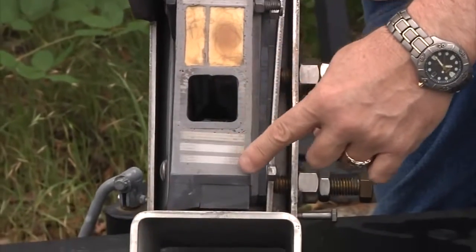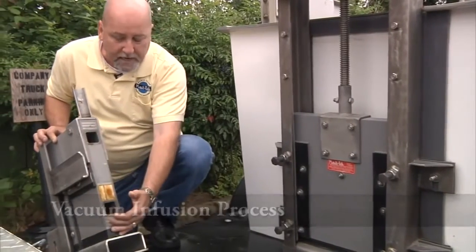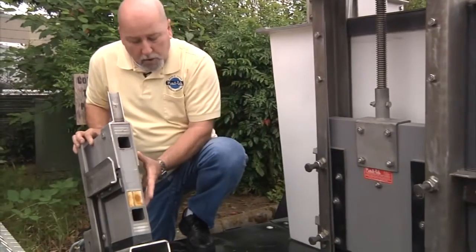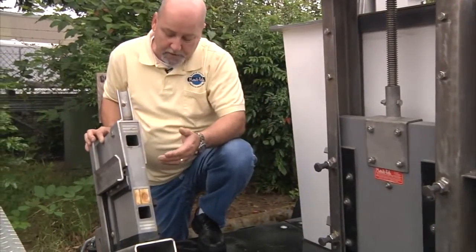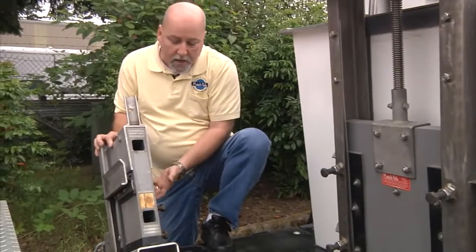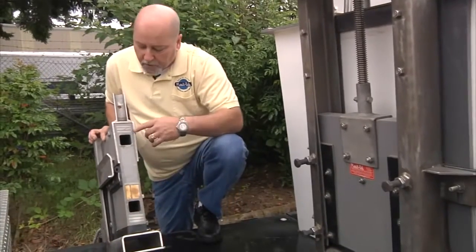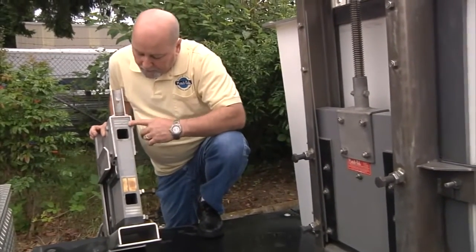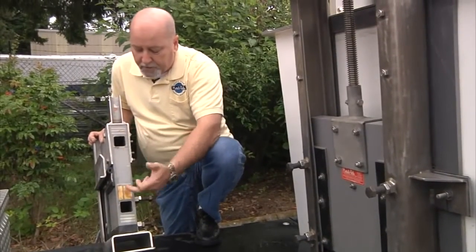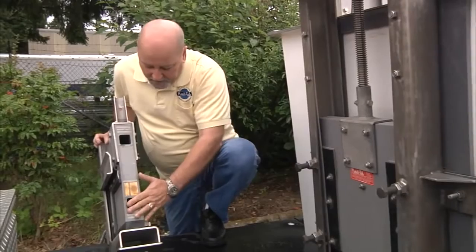The gate itself is a vacuum infusion product. What we do is it's actually made inside of a mold where we layer the fabrics down in the mold. We'll actually put a steel tubing inside of it, and we use a foam to help keep it lightweight. We'll close up the mold and hook a vacuum system up to it. The vacuum line is running down one side of the mold, pulling a vacuum as the resins are hooked to the other side, which is drawing the resin through the mold, totally wetting out the product altogether. If you notice, there are no seals or seams anywhere on this gate. It is a totally encapsulated product. We want to protect the steel from any corrosion ever getting or starting on there whatsoever.